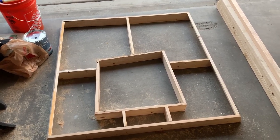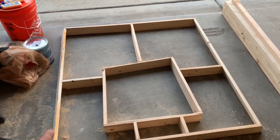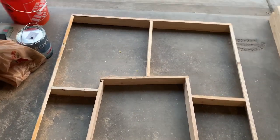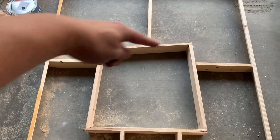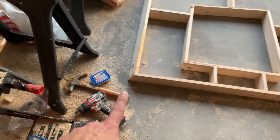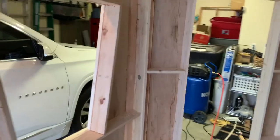Framed up one of the second stories. This is the middle section that is going to go right up here once I get it outside, right above the door. So this is the window framed in — this is a four feet by four feet square. I just kind of eyeballed this window; it's supposed to be two foot by two foot, but I kind of wanted it to be a little off-kilter just like everything else. So 24 at the bottom here, 23 or 22 at the top, and I just kind of lean those in a little bit — it's about an inch and a half drop across the top there. And I did these sides at the 22 and a half on both sides so that when we put them all together it'll form the outside corner.